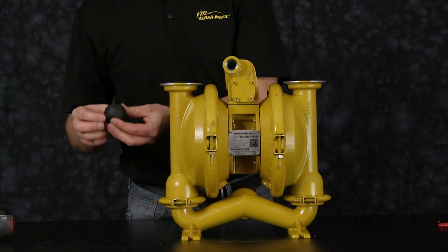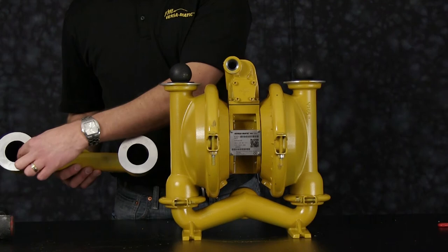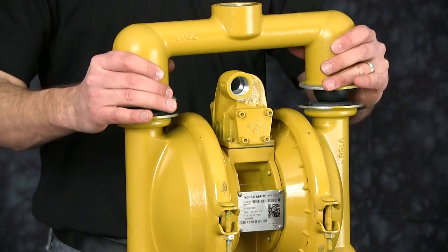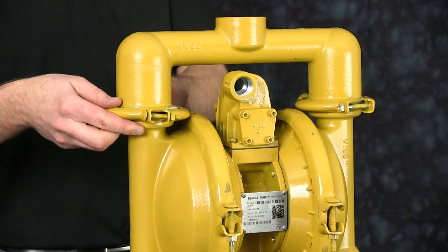Now we're ready to install our discharge valve seats and check balls. Note the orientation of the valve seat — the o-ring of the check valve seat will face down and the flat surface of the check valve seat will go towards the ball. Inspect the integrity of the casting of our discharge manifold. Inspect the machine surfaces and the ball guides for any sharp edges and address those sharp edges with light sandpaper, crocus cloth, or emery cloth. If too far gone or worn, replace as needed. Now install our clamp band assemblies over top of the outer chamber flange and discharge flange. There is no torque spec for the clamp band assembly, but tighten evenly.